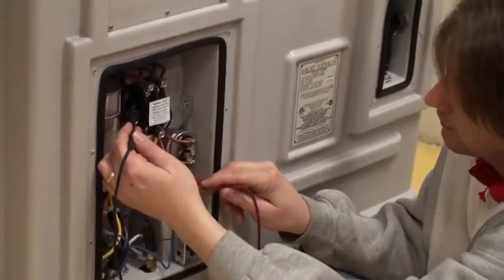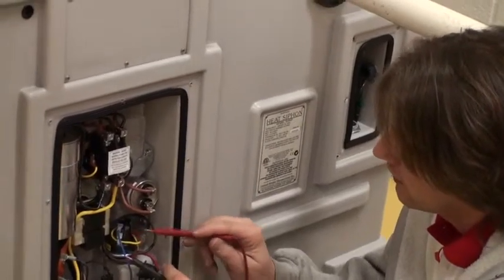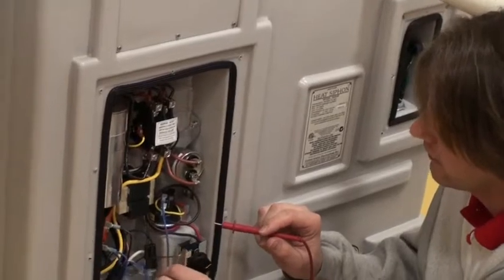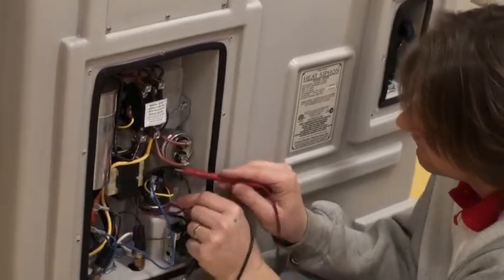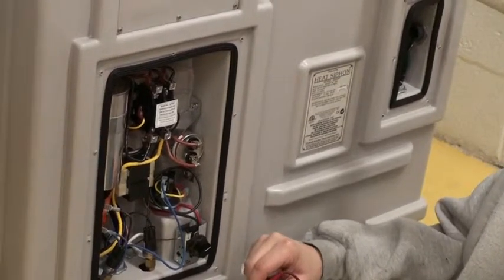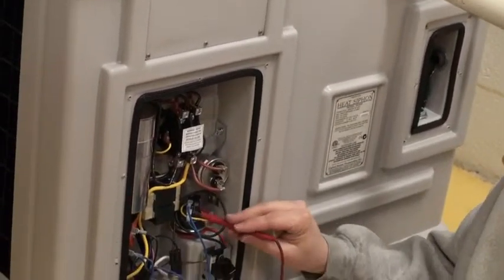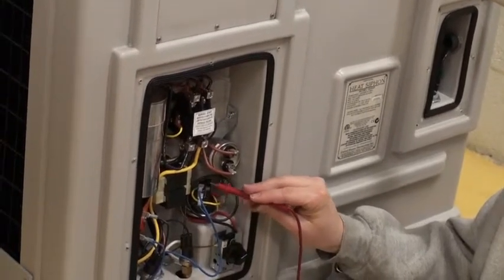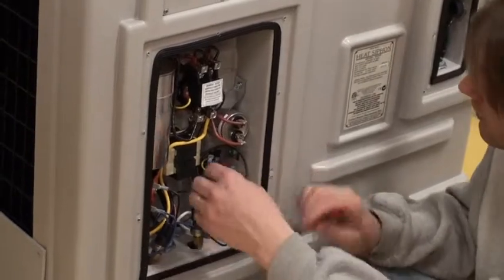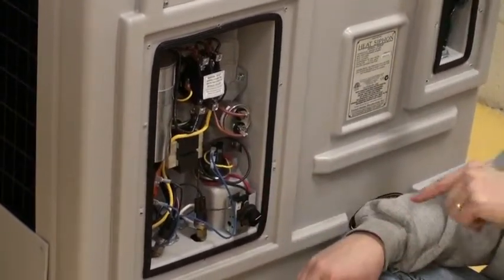Go to the top of the pressure switch. Yeah, the water pressure switch. I'm going to say top, but really what you want to make sure of is that this is the in. I think we've always done them on the bottom, but you want to make sure you're going to the thermostat's wire first, and then to the high pressure switch's wire second, where it's coming out. Because if these two are reversed, this switch doesn't care which way it comes in or out.